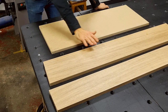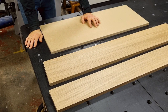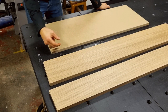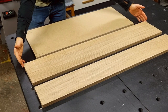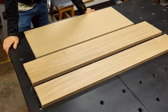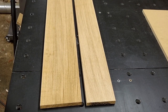These are plain and slightly oversized in thickness — 18 millimeters, while the base is 16 — so I have 2 millimeters extra to play with for margin when gluing to the base material. The pieces are also slightly oversized in length, which is always a good thing. You never know if you encounter snipe problems or other issues when you later plane the edge bandings to correct thickness. Here is the workflow.